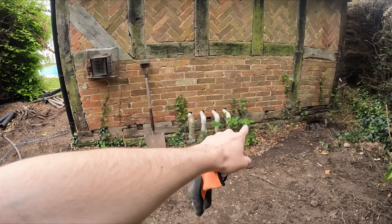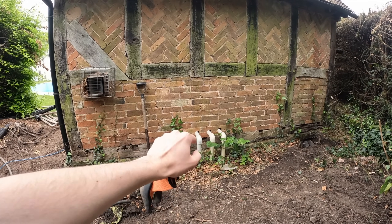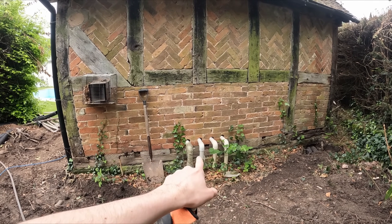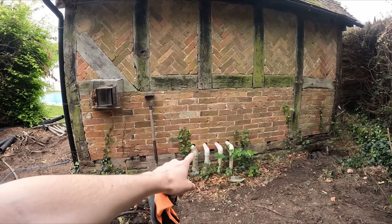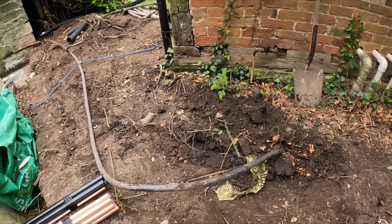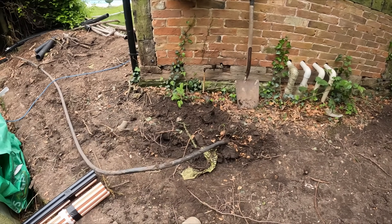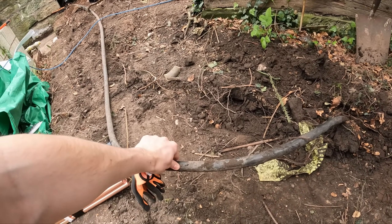We'll cut them off and those will be our holes into the pool hut. There's going to be a waterproof box there with a Verso fuse board in it. This 35mm armoured cable we've got to pull all the way up there, get enough slack to gland it in. I've never done a 35mm three-core armoured in my life, so it's gonna be interesting.